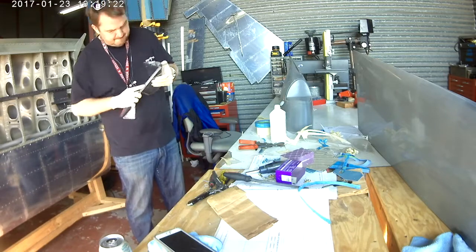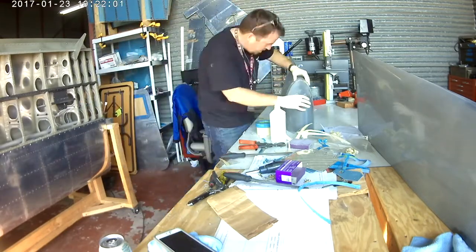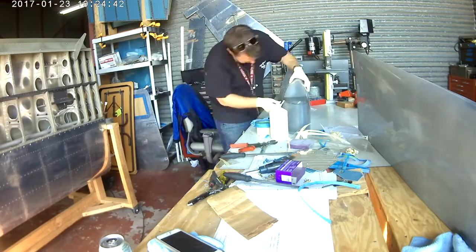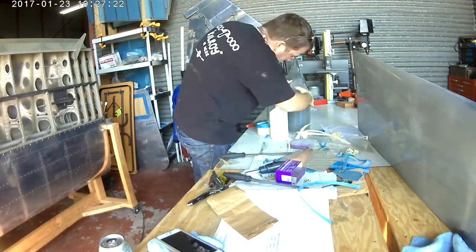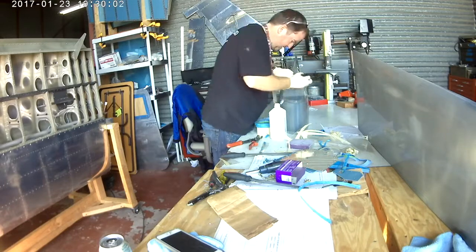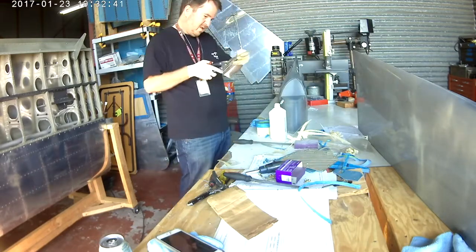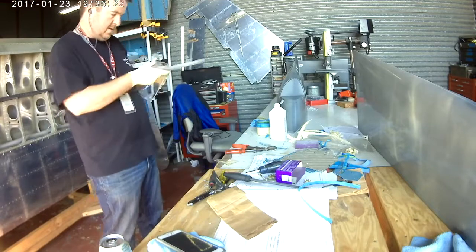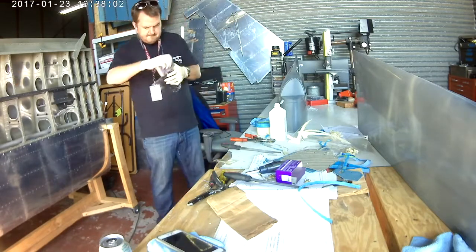Just trying to fit these. After you get them all to fit — there's a lip around the entire thing about an eighth of an inch — once the whole thing fits really nicely and the angle feels good, you want the plexiglass to basically sit there without needing to be screwed in, or with just a little bit of pressure. Then sand the edges smooth. In the next video we're going to put in some nut plates.